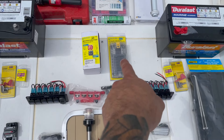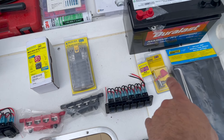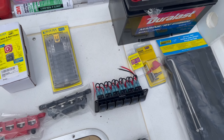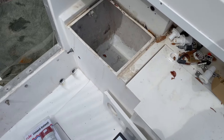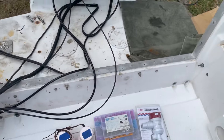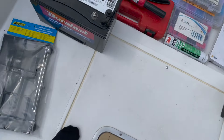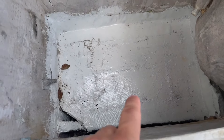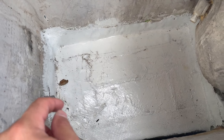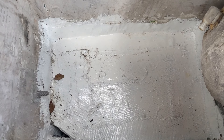I didn't skimp on the ACR kit, the fuse block, the fuses, or the terminal fuse block — I got Blue Sea Systems, which is pretty good. The batteries go in their cubbies on these battery trays so they're secured and won't move around. I redid this piece with some plywood and fiberglass — a couple layers of 1708 — along with silicone and stainless steel screws. Let's get that installed.